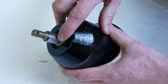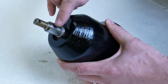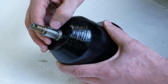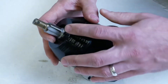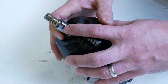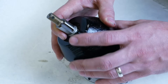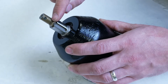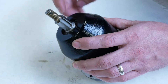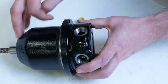On the outside we have our keyed shaft. Any time we have a keyed shaft, that's our point of failure. In the event of a mechanical bind, what will happen is that we will break or split that key, and then our driven component will end up spinning free from the motor. This one just has a lock nut that holds the fan blade on, and a cotter pin to hold the fan blade in place.